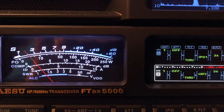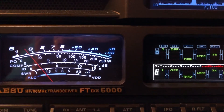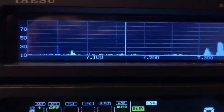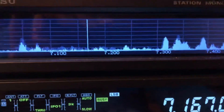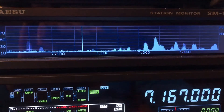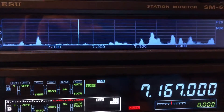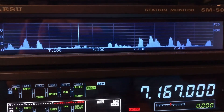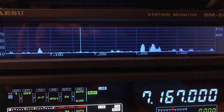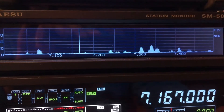Digital noise reduction — best in the business. Micro Tune. You'll notice the micro-tune — look at the scope up there. It's a pre-selector, so it's narrowing the front end, which, if you look up and down the band there, what's going to happen is the noise floor is going to drop.